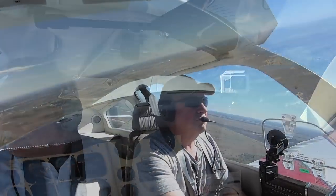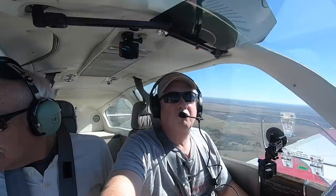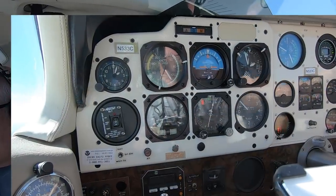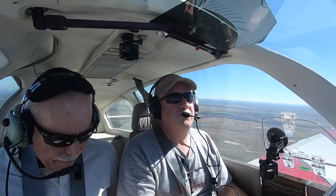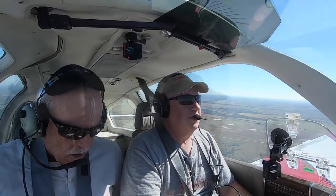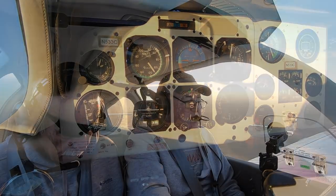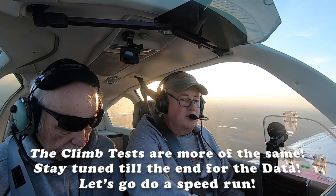Portland traffic, RV 2626 Mike, 8 miles west of the field. We'll be crossing over the field and we're in a long downwind for runway 17. Coming up on 2000, 2000 mark. Temperature is 66. Fuel flow is better than 24, 27 inches, 2660 RPM. Climb speed is about 1,200 feet per minute. Temperature at 62. Hack. Climb is 1,100 feet per minute. Manifold pressure is 26.5. Fuel flow and RPM, no change.